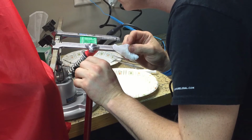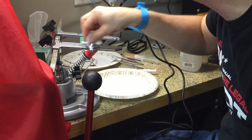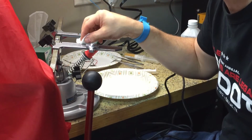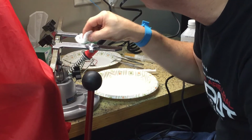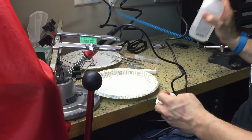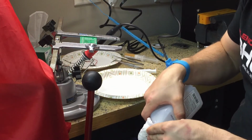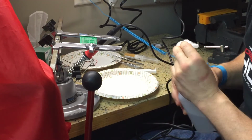If I thought any of those resistors were bridged together, I'd take a multimeter or voltmeter and check to see if they have no resistance, then you'll know you've got a problem. In which case, these small resistors would probably be easy to take off, but you might need a hot air gun to take off something more complicated, like the IC in the middle there.